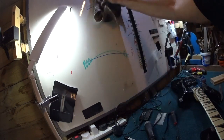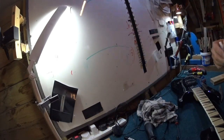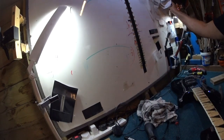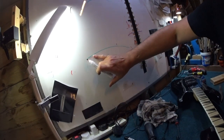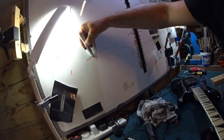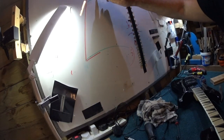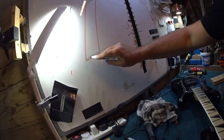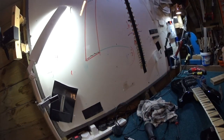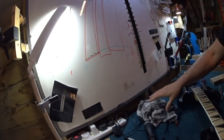However, nor is a fairly wide beam either. 12, 14 at the end, right? If you put a wide beam down there, let's do it in sort of 3D cross section. The thing you know straight away about a beam is it doesn't even have a curve on it at all, so it's a flat. Let's say there's your beam, and at the other end it's a flat too. Look what it does: you will impose a flat onto that curve at both ends. That looks okay down there because it's flatter, but that's why a flat beam isn't an ideal situation. And you'll end up doing it probably 3 times, and you'll map the whole of the curve across the neck in 3 chunks.